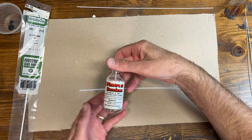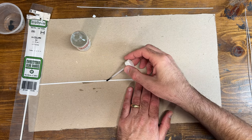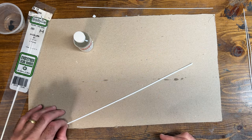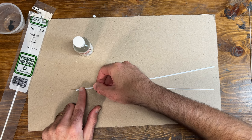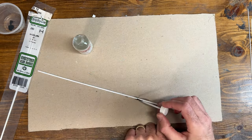I just placed two of those pieces of half round side by side and then used some plastic bonding solvent to attach them. Once it had dried for a few seconds, I flipped it over, put more of the solvent on the back, and attached the third piece of half round in the middle of those first two to create the overall profile.